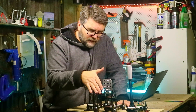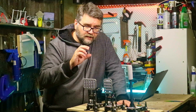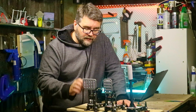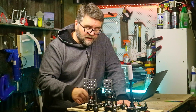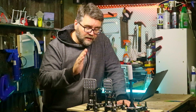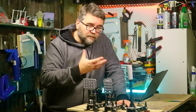One problem you might get is if you push the pedal all the way down and the light flashes back up again — that means the magnet has reached its edge and flipped poles on the sensor. That's when you need to start tweaking the position of the magnet relative to the sensor. Just loosen those screws, twist it around, and move back and forth so that at full travel the light is all the way off and doesn't brighten back up again.